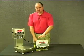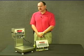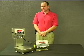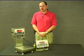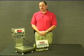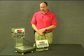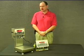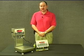One thing that the two units have in common is the breather vent. On the back of each unit there is a breather vent installed that allows the pressure inside the indicator case and the outside of the case to be equalized. Typically these units will be installed in a hostile environment — for example, in a very cold area and then washed down with high temperature, high pressure water. By use of the vent, you have the pressure equalized and water is not wicked in past the seal in the unit. This is a very important feature and allows us to get that IP69K rating.